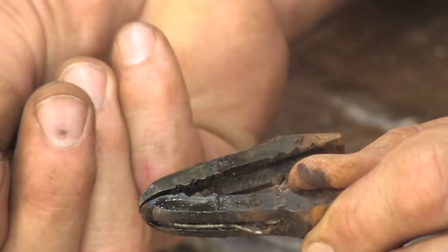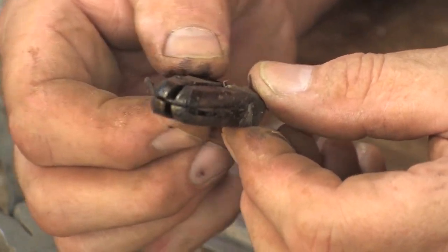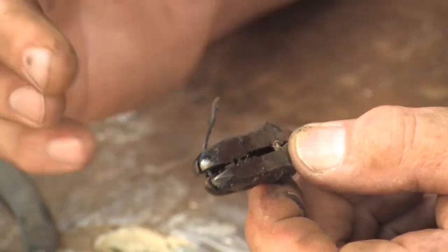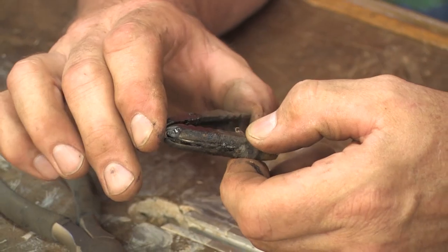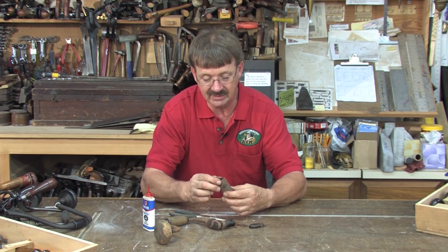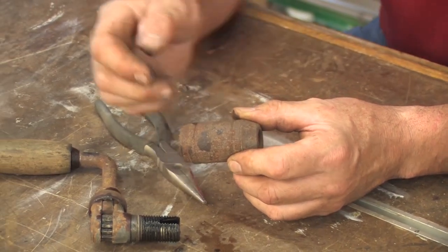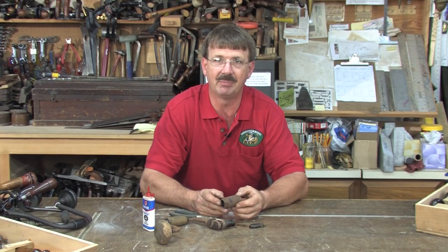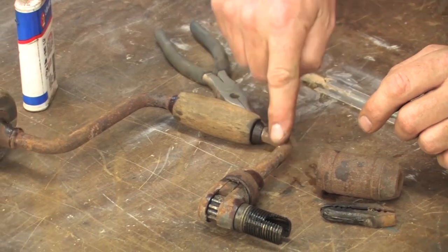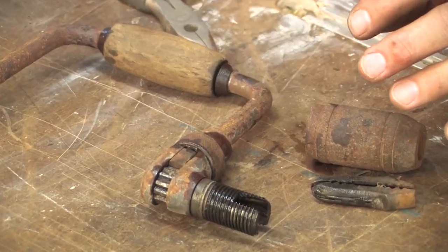Whoever had this had some pretty thick gunk on it, and that actually may have saved us a little bit — the fact that they had some grease in there. The jaw should stay sprung open, and that's why we want to try to get this. If the spring is actually broken and free, it's still going to function a little bit but not as smooth as we want. But again, we started out free, so anything we can pull out of this, we're ahead of the money. I'm going to try to get the knurling on the outside of this shell — a lot of it's rusted off. When you're working your wire wheel, you want to just take little scallops of the wheel as you go around. There's no reason to try to get the wheel to do half the bow at one time — it's going to pull it into the machine and smack you.